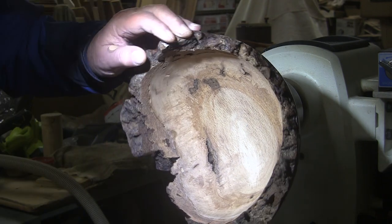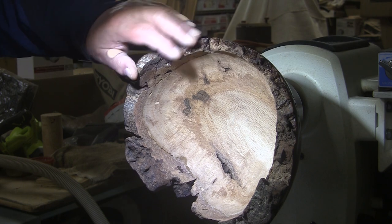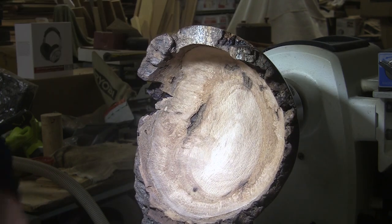So that's what that looks like, and that doesn't change how the bark looks. It just makes it feel much nicer and less sharp, and just cleans it up, makes it feel good. Then with the 2-inch disc sander, the lathe spinning forward, we'll go about 380 RPM.